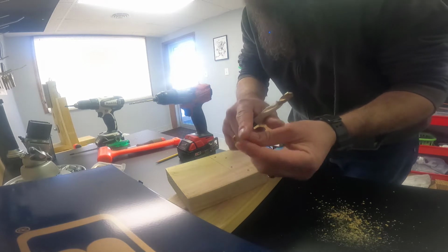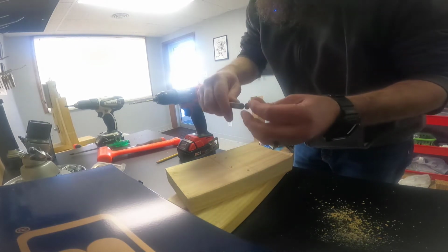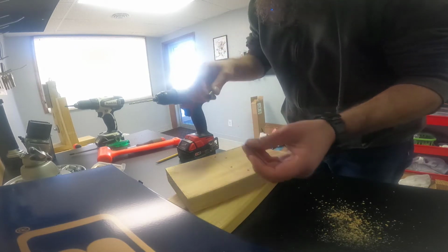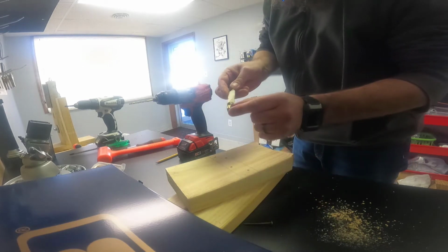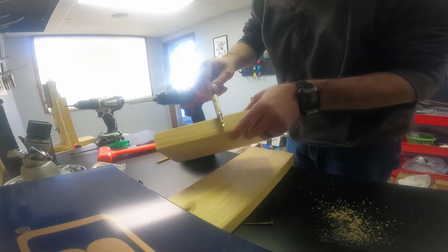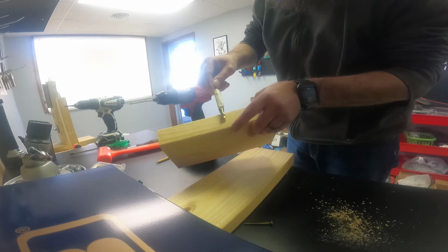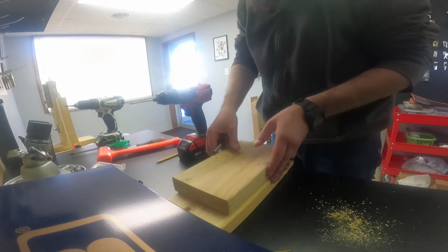since these are cabinet screws with a very bulbous head, I picked out a drill bit roughly the size, and then I'm gonna, what is it called, countersink. It's gonna go in about this far, maybe not that far, but you know, a good halfway through, just so I get more meat going through into the other board.